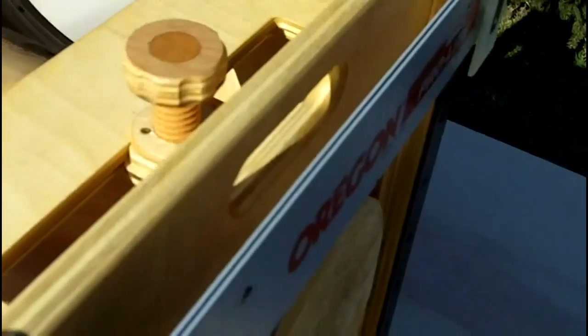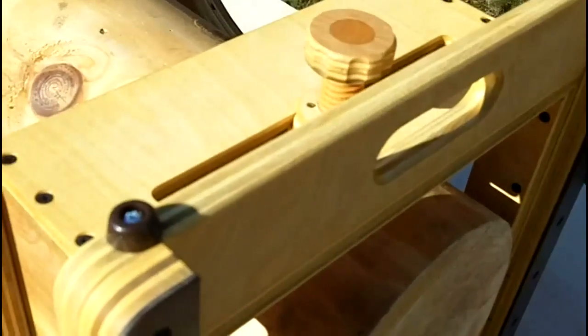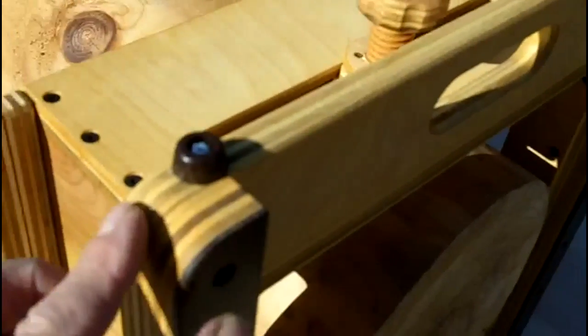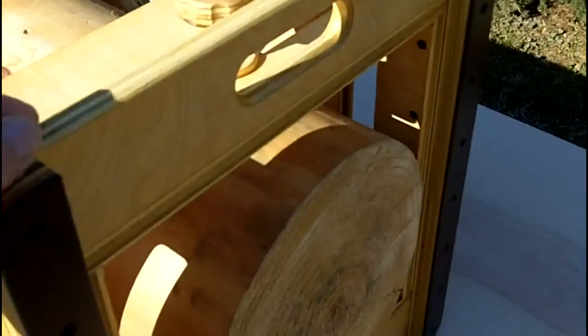And see how far off the jig the cutting path of the chain is going to be, so that when you're guiding off of the end with a router off of a side, the router bit can go a certain depth. We can increase the length of this depending on how deep you want to put that dado in the end.